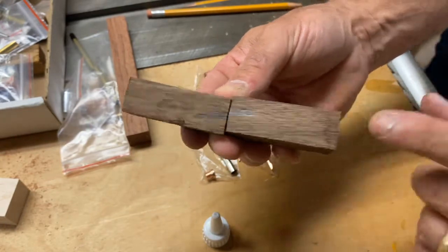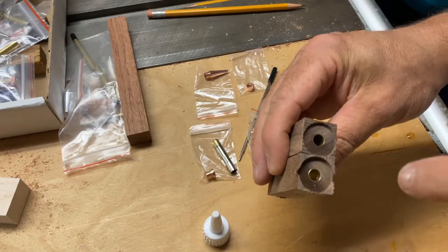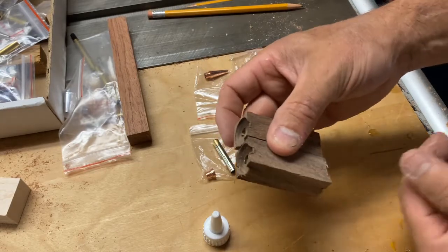Before we go to the lathe, actually, we got to square up the ends. So I use the squaring tool. It has a core piece that goes in, and then it brings it down to the brass. You just take your time. So now that's going to be the length of our pen. Everything else we're going to carve away.